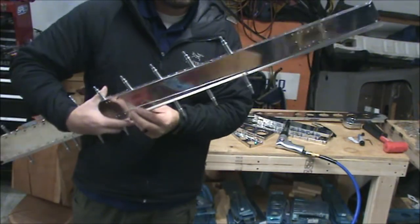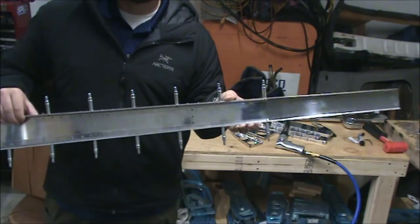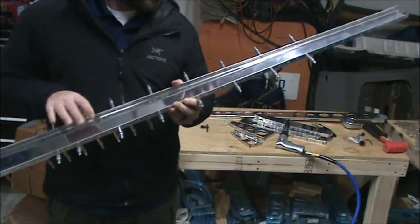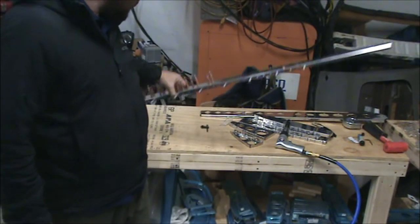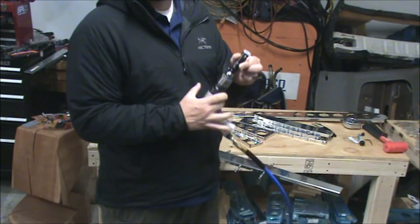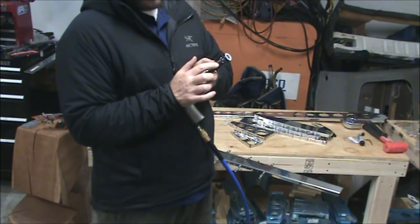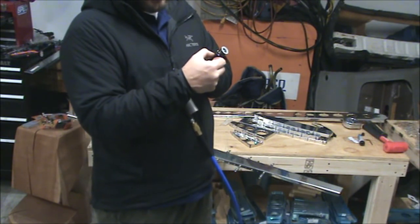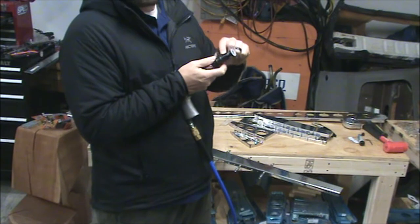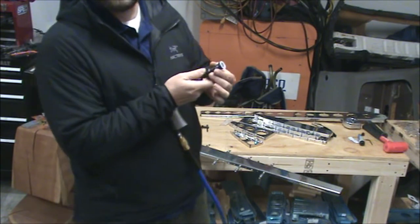So I had that set correctly, and on that one it took about nine clicks to get the right depth for the skin to sit in there. At this point it's set up and ready to use — I just have to lock down that collar to make sure it doesn't adjust. A trick that some people do is they put tape on both halves and put a line on one part as an index line, and on the other piece of tape they'll put lines — one that lines up for nine clicks in.